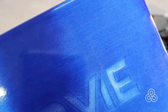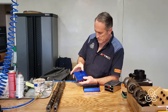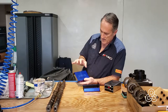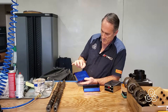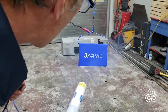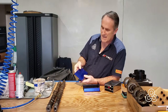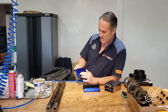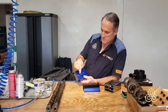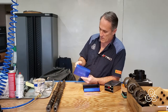I could have lived with that, except I also tried to put a vinyl logo on here. I put the vinyl on, powder coated it, and then before curing I peeled the vinyl off and put a real light coating of intense blue over the logo, thinking it would be a lighter colored blue with the logo and darker on the outside. But the Faraday effect seemed to have focused the powder right around the edges with little piles in the middle — and anyway it turned out really crappy.